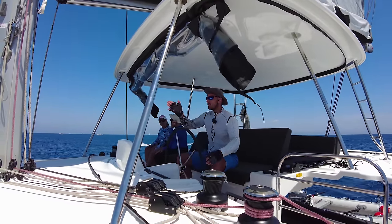If we only had just a small jib, this would be a disaster. We would need to put another rope on the cleat, as I've showed, because the self-tacking just doesn't work downwind, and then the surface area is too small. Then we could open the main sail, but because we're going downwind, the jib would be in the shade. So we would have to zigzag. It would take way longer. With this sail, see, we're just going straight downwind, having no trouble, great speed, and so much fun. So light Genoa is the way to go.